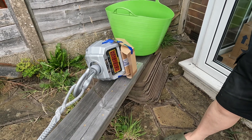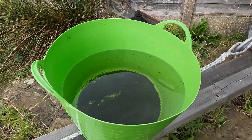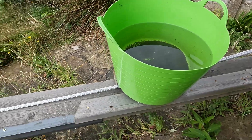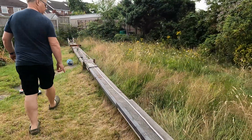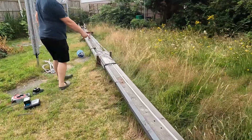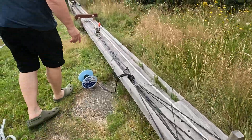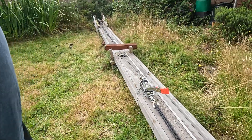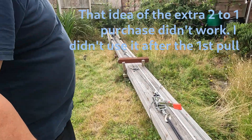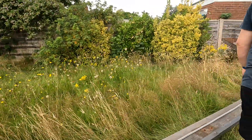I've beefed up the timber here with some metal that was about to go for recycling, and we've got the scale now at this end, which makes a lot more sense because we're not trying to use the scale as a low friction device for anything moving. The scale is now essentially static, and so are the ropes attached to it. That's anchored around the end of the big plank. The reason why we have buckets is because we don't want to fasten anything into our patio — we're just trying to weight this end down so it doesn't bend upwards. Then here I've got the anchor for the come along, which is pulling two ends of the low friction lashing, but the two ends are actually fastened, so that gives us an extra two-to-one purchase.